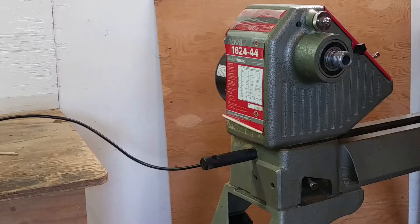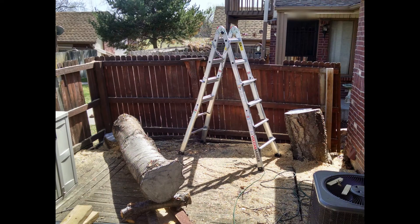I would recommend turning the swivel head out in increments that can be locked in place with the headstock release handle. What this allows someone to do is turn very large pieces of wood, changing the maximum radius of the spindle from 8 inches to whatever the distance is from the center of the lathe to the floor. This is really helpful for turning large items, some of which I'll be doing in the future.